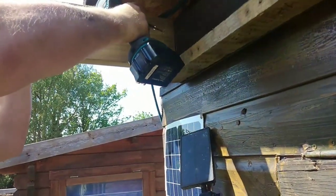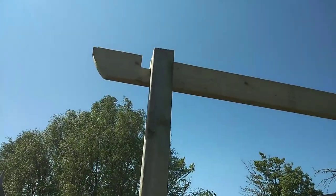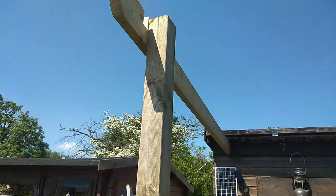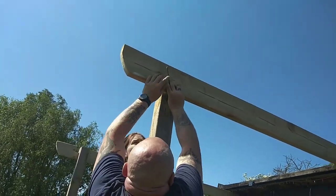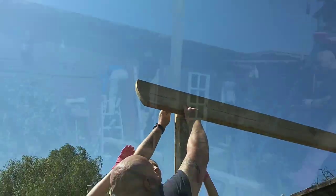I'm screwing the other end in with 4-inch screws for now, but it will get joist hangers this end. So that's this end — nice, secure and stable. We can work on the other side and basically just do exactly the same thing: mark the level, mark it on the other side for the cross-halving, just run the pencil straight down that piece of timber.